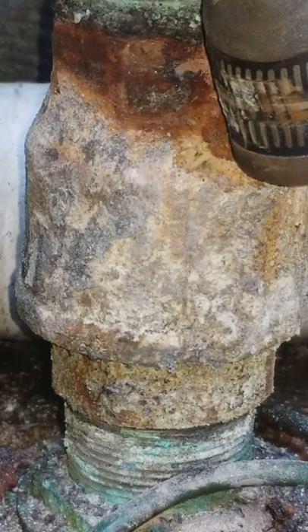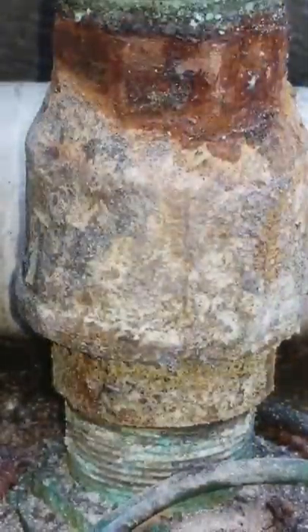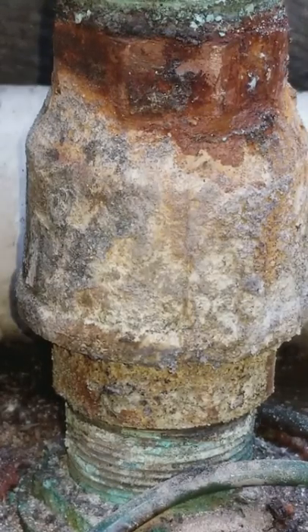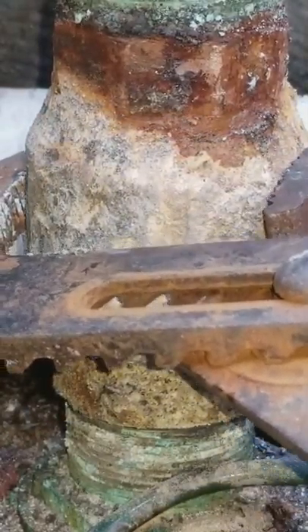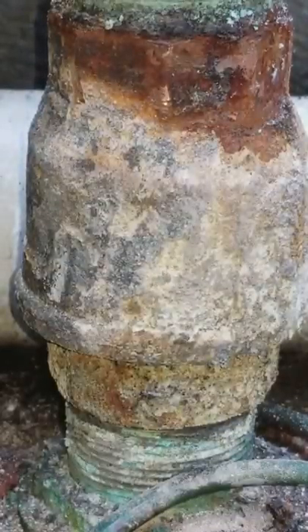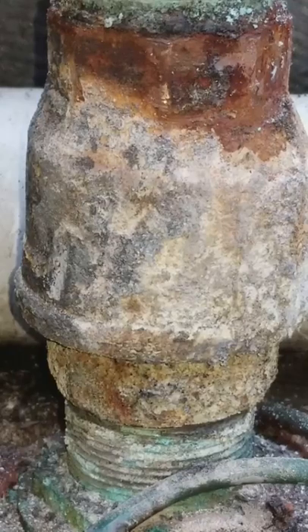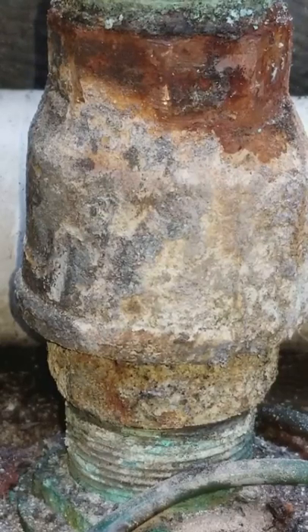Okay, this is how it's done — remove a seacock while it's still in the water. Take off the upper hose off the seacock and set it aside. Get your wrench — I've already broken this loose — and with your channel locks have everything in place. You're gonna need a plug that fits the hole, a tapping device, a hammer, and have the other seacock basically in hand ready to go.